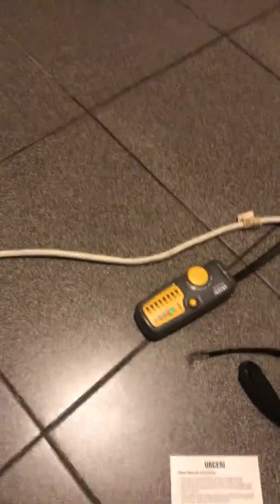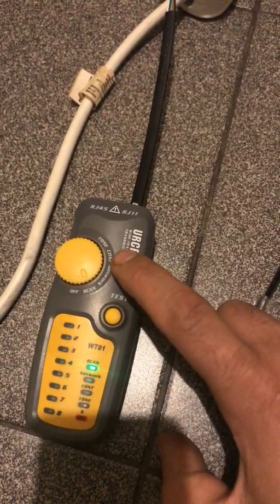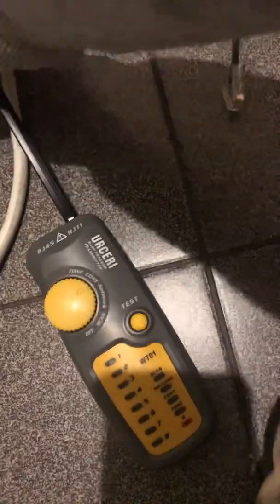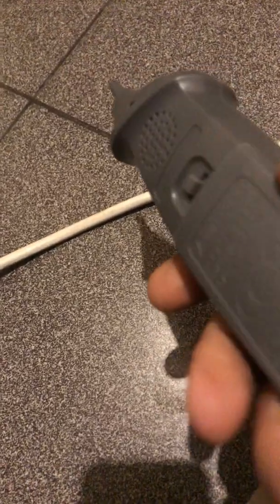That's pretty much it. I'll be going on site on Sunday — I have a job there that needs cable identification. You've got your scan, network, and continuity functions. Continuity is quite good — it just saves you the trouble of getting another tool out such as a multimeter. Touch these together and it also shows you reverse polarity. Very nice device — can't go wrong with the price. I give it a definite thumbs up. If you decide to go for it, I would say yes. Thanks for watching.